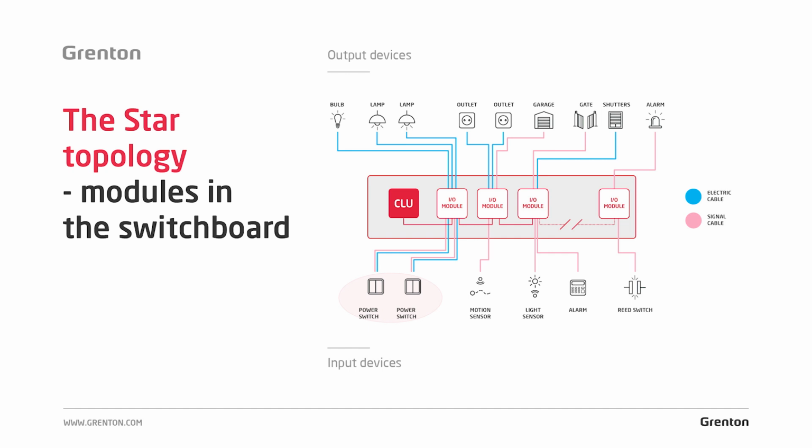When connecting the switch keys for a single switch, two wires are used. There is one wire to be connected to the ground connection, and one to be connected to a specific input. There will be 3 wires for 2 keys, one to ground and 2 to the first and second input. A free pair of such a cable can always be used to connect temperature sensors or additional devices in the future.